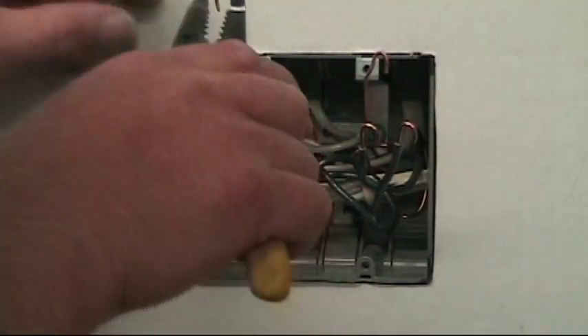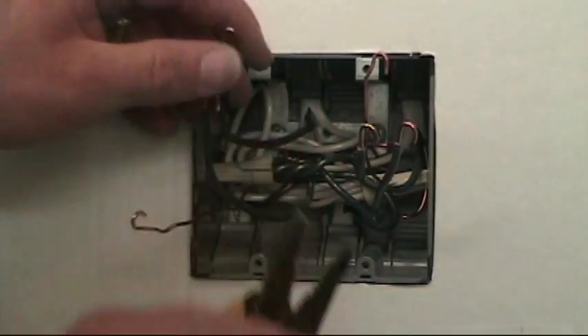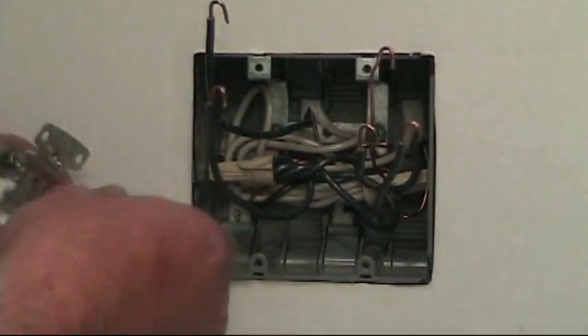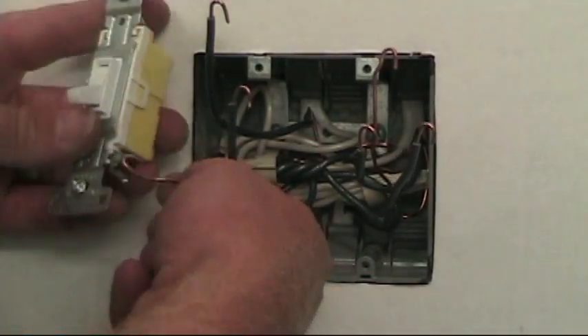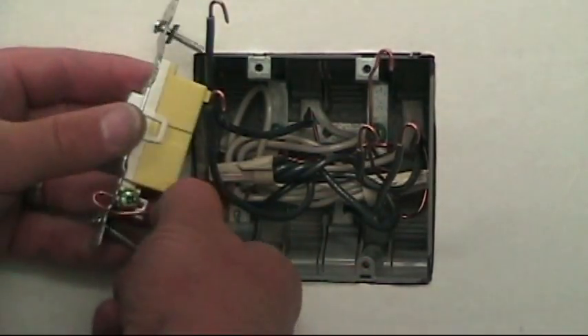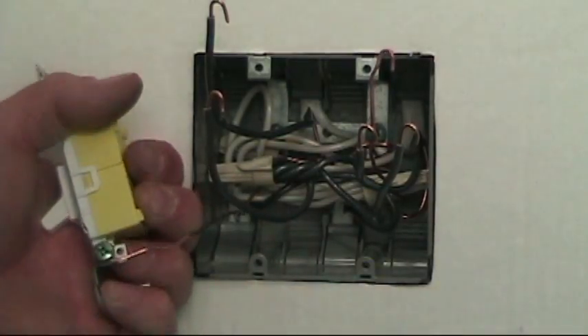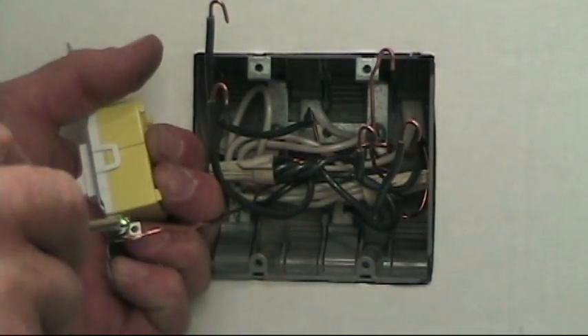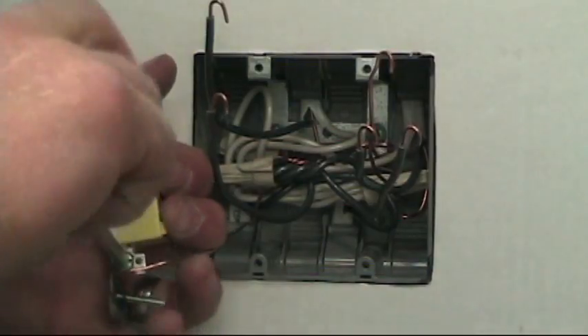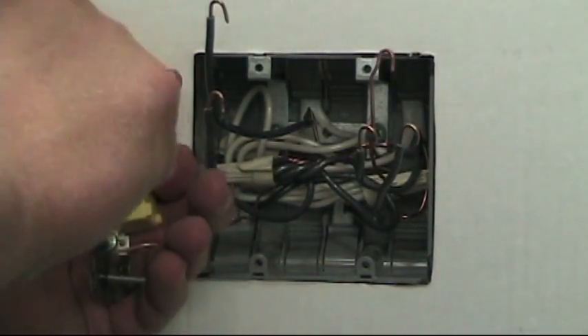If it's not quite right, you can just position it a little bit with the jaws of your plier. I always work by tying the ground wire on first. Hold the switch in your left hand if you're right-handed. Get the ground wire around the screw in a clockwise fashion around the screw terminal. Tighten up your ground first — nice and snug.